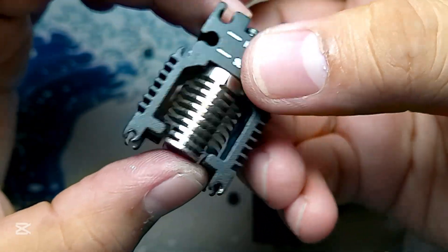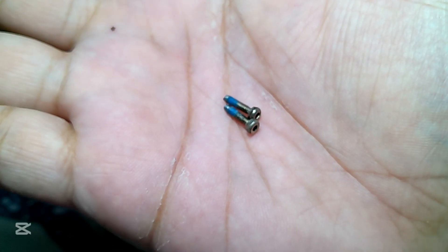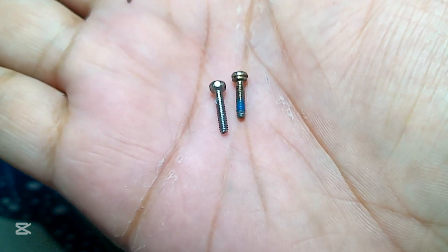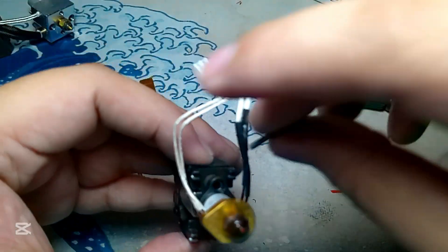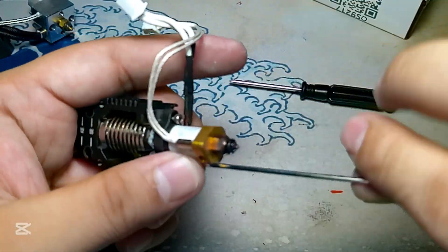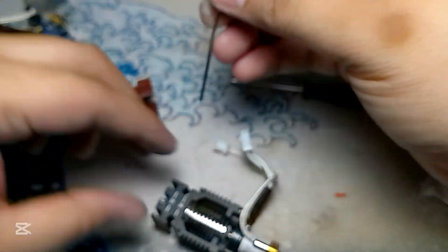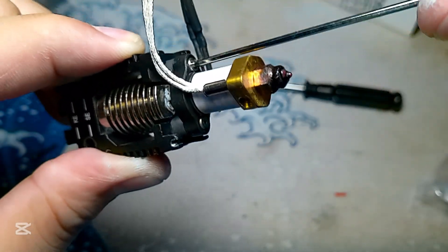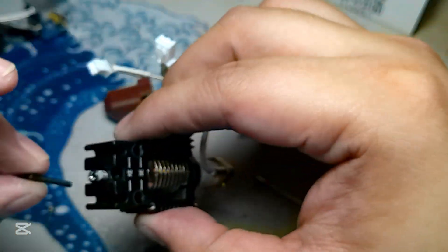The main issue is the screw is not biting on the thread itself — if you take a look at the screw, it's just biting at the very end. What I did: I got the old hot end. If you remove it, it actually has two screws as well, which is the same on the ceramic block, just longer. I replaced it with the other screw and hopefully it actually solves the issue. And I can actually feel that it is biting now on the thread itself. It just hits the other heat sink there, but I think it doesn't really matter.